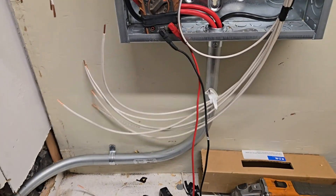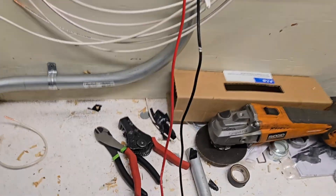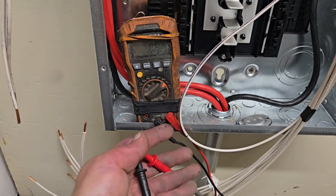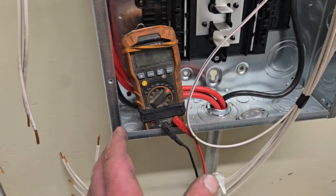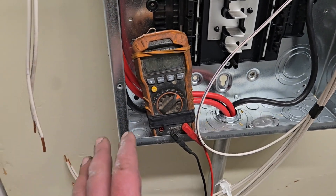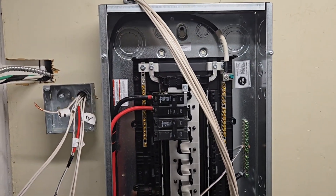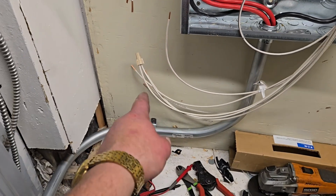When you get your multimeter, just go through the settings until you hear a beeping when you hold the two leads together. If you're buying a multimeter, it should say on the package 'audible continuity' — make sure it says that. That is the handiest feature on a multimeter there is. That's how we do it — audible continuity, really easy, really quick, really efficient.